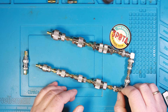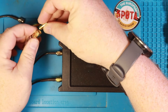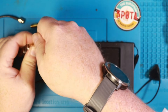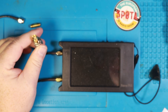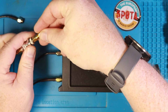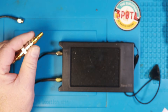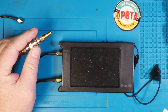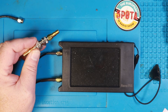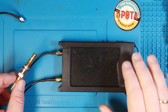First, we're going to measure insertion loss through the set of two adapters, then measure insertion loss through a chain of 20 adapters and see if there's any difference. We'll put a couple of barrel connectors on these SMAs, since I used most of my other adapters on the long chain. That will probably add a little bit of insertion loss, but it's unlikely to be a big culprit.